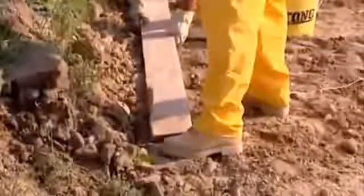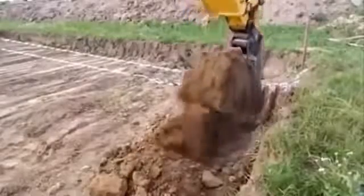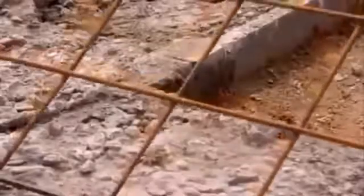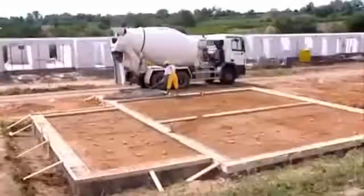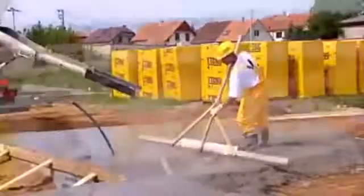The building site is prepared in the same way as any other. The most important steps are setting out and digging the foundation, compacting the base, placing the reinforcements, and concreting over the foundation plate. Of course, all the steps are vital since the quality of the foundation affects the whole building process. Thoroughness pays. Any imprecision at the beginning is hard to make up for later on.